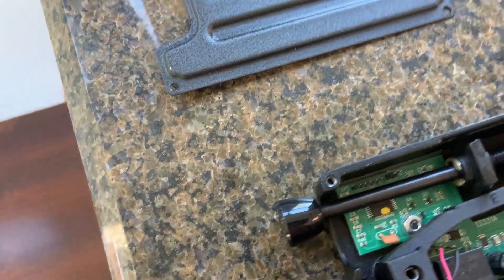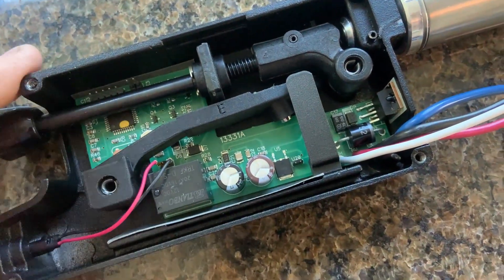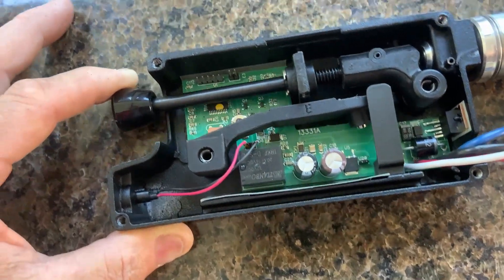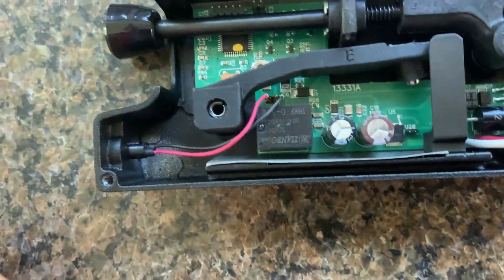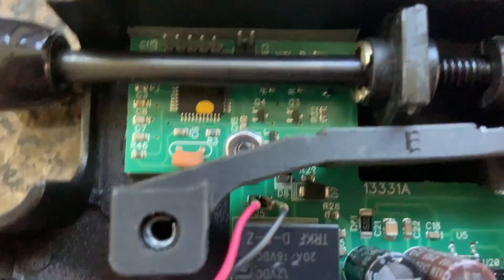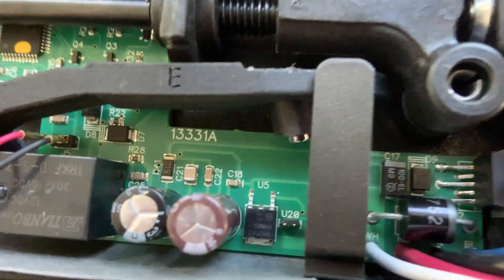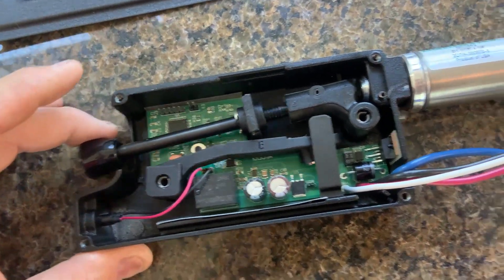When air pressure goes into this cylinder it pushes on this lever, which is the same thing as doing this function right here. This little silver piece right here is a magnet. There's electronics in here — I believe it's that little U20 device, or one of these pieces in there, that's detecting the magnetic field strength, and that's how it's varying the current going out through that big transistor right there on the back.